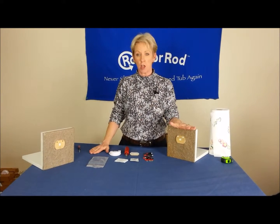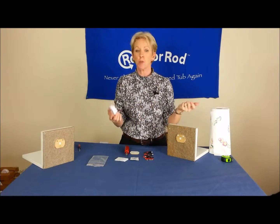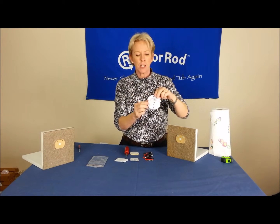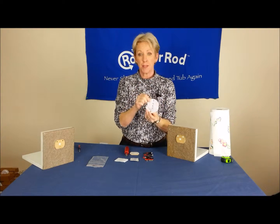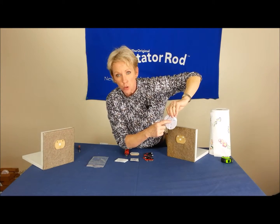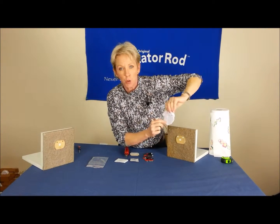This is rock solid. The last thing we're going to do is attach the wall mount and then snap the rod in place. We're home free now. So we're going to take this wall mount. Make sure that the lip of the wall mount is toward the ceiling. This is upside down and it won't work. It just won't work. A couple of things. This center hole is only to secure the rod in place, and these 2 holes are for the screws that we're going to put in.